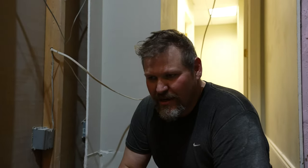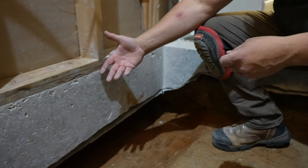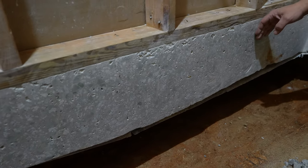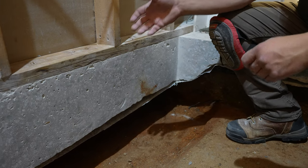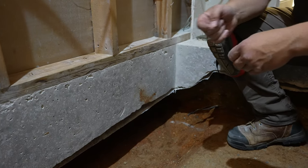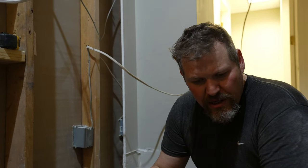You're looking at what the Makita did. It got us pretty close — we had to finish that with a cup grinder. We were able to get about an inch and a half away, and then we turned the big guy sideways and cut a whole bunch of slits, knocked it out with a chipping hammer, and finished up with a cup grinder.